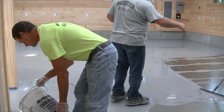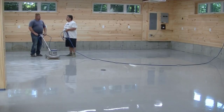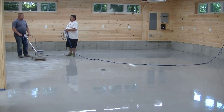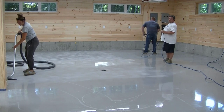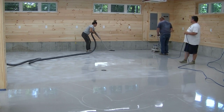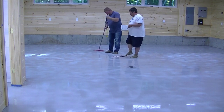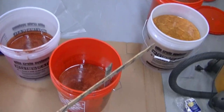The basic steps to getting the base coat down: we measure out our square footages, put a little piece of tape on the wall, squeegee out the gallons we mix — usually about three gallons at a time — then back roll it and get it all smooth. The next day we sand the epoxy, because you'll get some dust that settles in it, even some bugs — a spider, a fly — that cause little imperfections. So we always sand it down, sometimes with a buffer, sometimes with a pole sander almost like sanding drywall. Once sanded, we vacuum it all up and wipe it down with denatured alcohol to get it nice and clean.